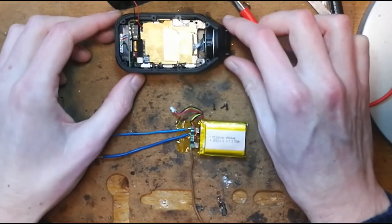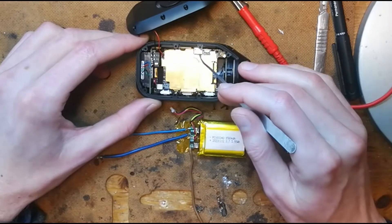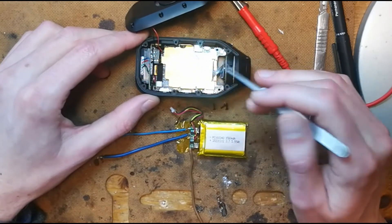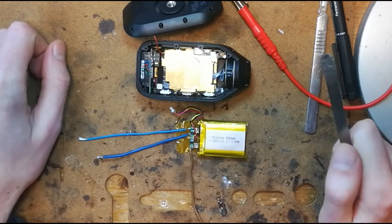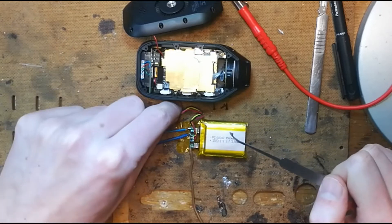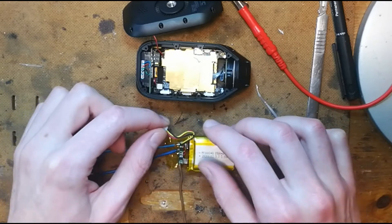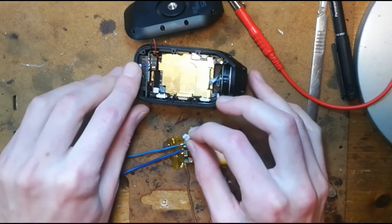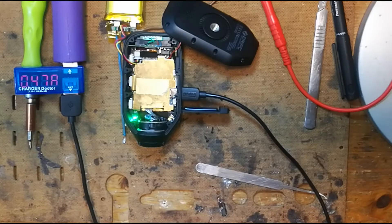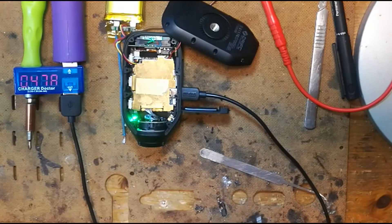What I'd like to do is try to directly solder to the positive and negative of the USB lead and wire that directly to the battery, so we can bypass any intelligent charging going on inside the camera. I suspect the camera is cutting off charging for some reason. Plugging in the battery with the metal connector points facing up, we can see 0.47 amps — 470 milliamps — being provided, which matches the behavior I saw before. Let's now check the voltage being provided to the battery.